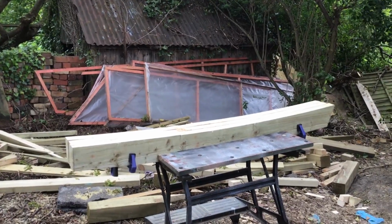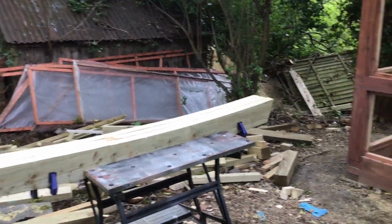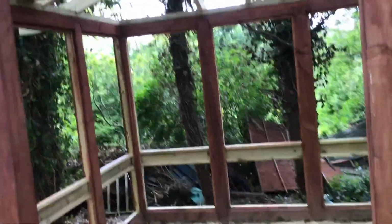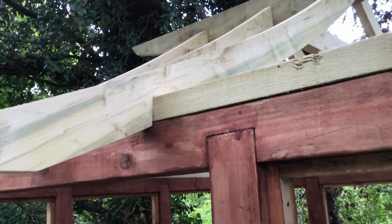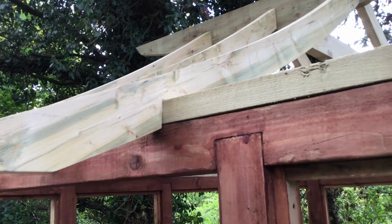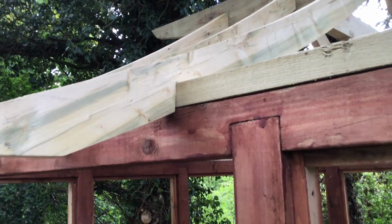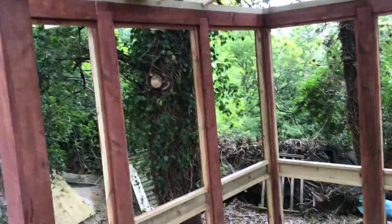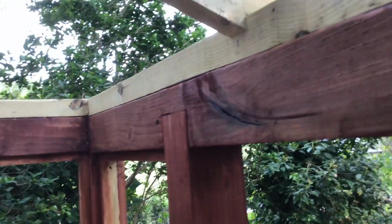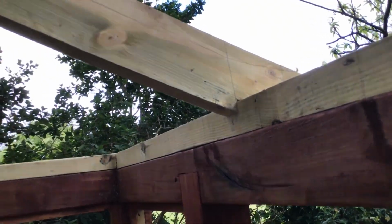This time I've decided to leave the bird's lip out. The bird's lip, for those who don't know, is essentially the cutout just there that anchors over the main lintel for the rafters to sit on. It's that little lip. Internal, that's a 60mm cut out there, and internally, because the rafter goes up in a curve, it's only a 20mm. Okay, so that can't move either way.